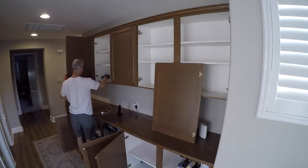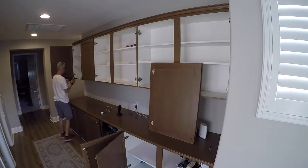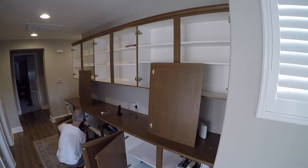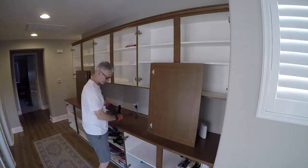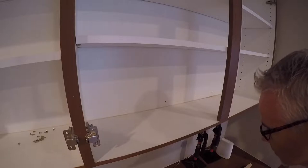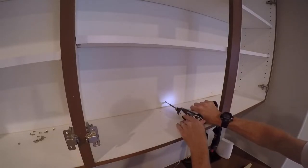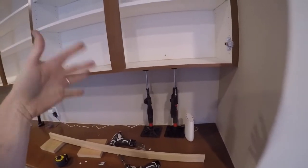First things first, we've got to take off all the doors. I'm going to leave the hinges in place because that will help me immensely when I go to put the new doors on. Even though the hinges aren't adjusted totally well, they are adjusted better than if I were to take them off and scramble them up. It took me about 20 minutes to remove everything. Then I'll put my wood strip in, making sure it sits nice and tight. I have to remove the screws holding up the cabinet and counter-bore them so my wood piece will sit flush. This also confirms that I'm hitting a stud and not just a false screw — it helps locate the studs.